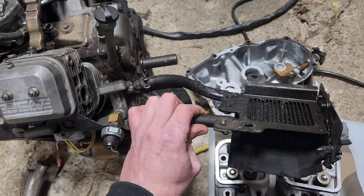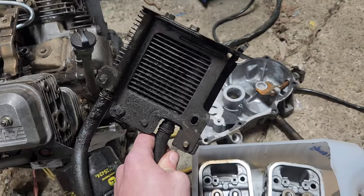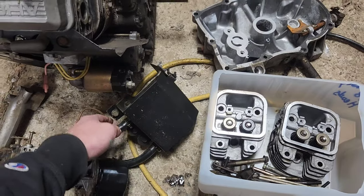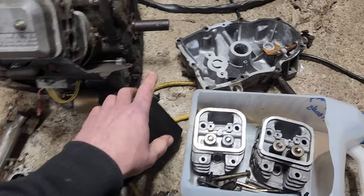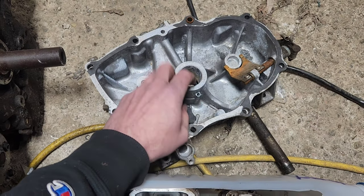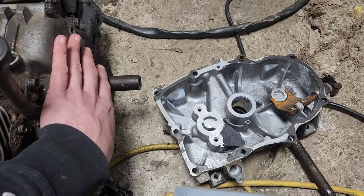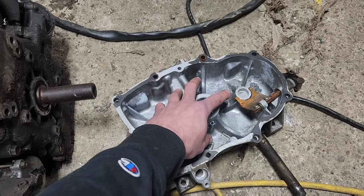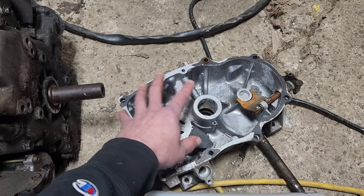If you can't fit more oil in the engine, you fit more oil outside the engine — which is another thing we'll potentially be discussing doing with the Predator. But this is based on the idea that you have a pump. We can see it coming in, pumping right in here and spewing out all across the crank to coat everything, and it also acts as a slight splash lube system as it contacts the base of the cam gear.